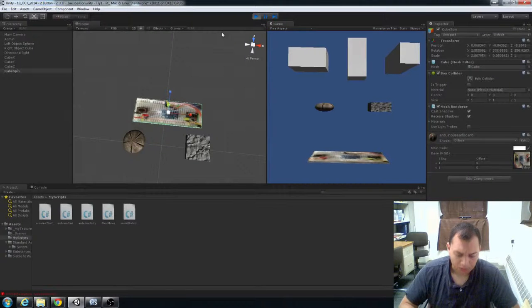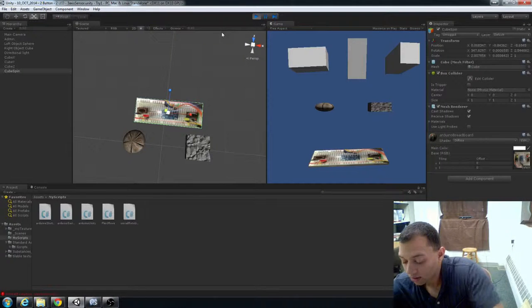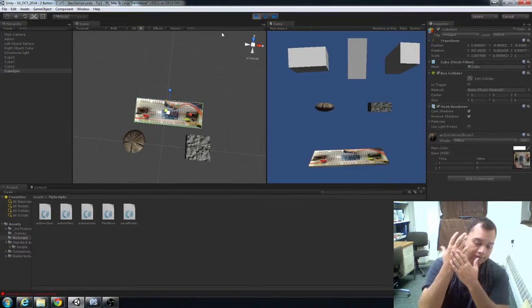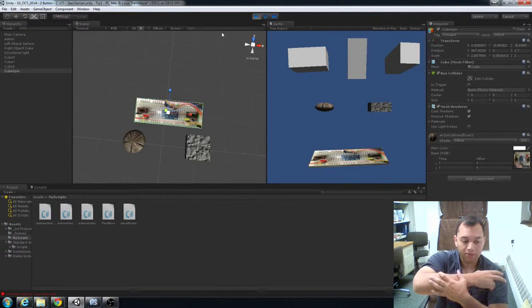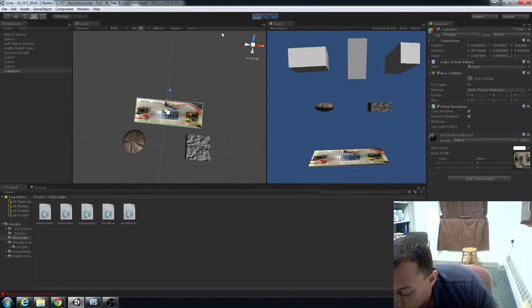To add in a little more, one of the things that I want to work on as far as my controller is the concept that you'll have a portion connected to the back of your hand, laying flat there. You'll have something that will sense your fingers, and then you'll have the Arduino, because this isn't a commercial product, this is just research. The Arduino and everything will be mounted to the forearm back here, with some type of strap. And then in the hand and in the forearm will be two of those vibration motors that I showed you in the last couple videos.